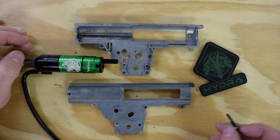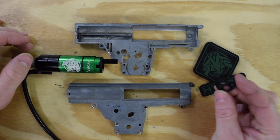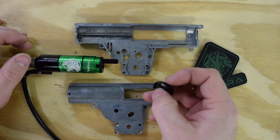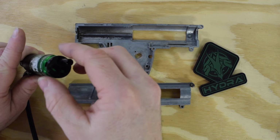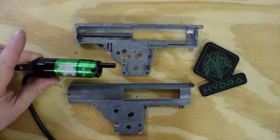If you're switching between nozzles that are not on the same bushing plate, then you might need to get the bushing plate to match your nozzle. So just be aware of that. Definitely check that out. It's very easy to swap. Just 3 screws here. That's also how you index the plate. You rotate it to use a different offset position.